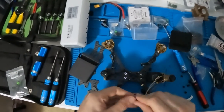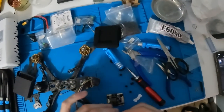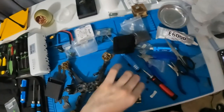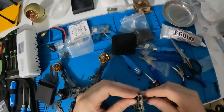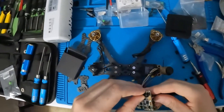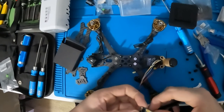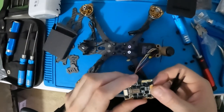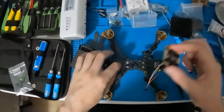There's a method using dental floss to get these gummies in, but I'm just going to use the good old tweezer method. Stick your tweezer needles through, pull them back just a little bit to get them to open up, and push them in until you really see the tweezers grabbing — then pull that in. That's one gummy down, three more to go. Now that we have our gummies in the ESC, the next step is to plop it down. I like to install the air unit first because I like to run the cable under the ESC.